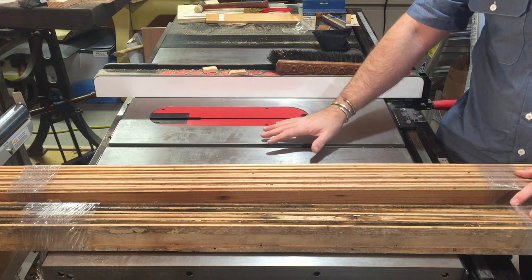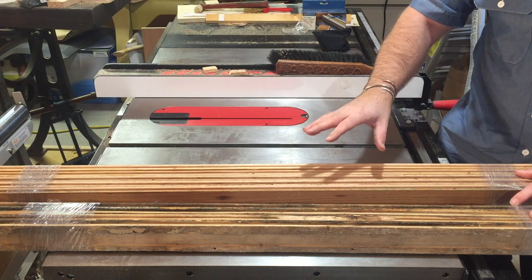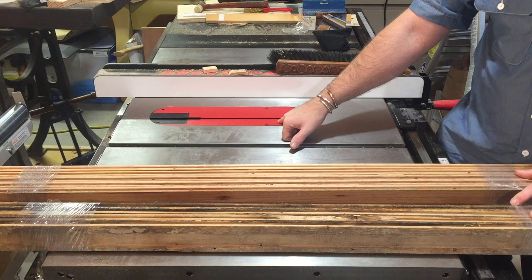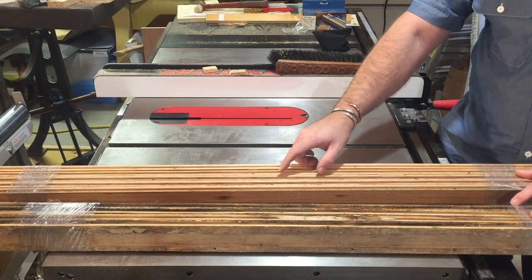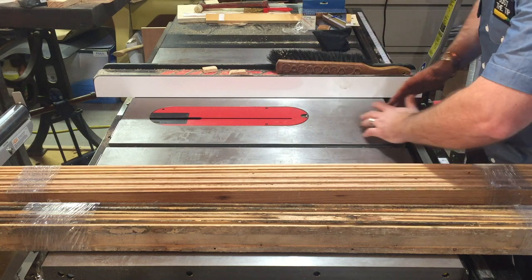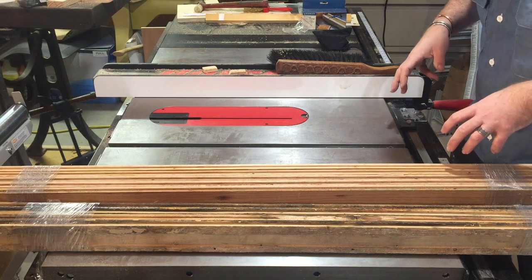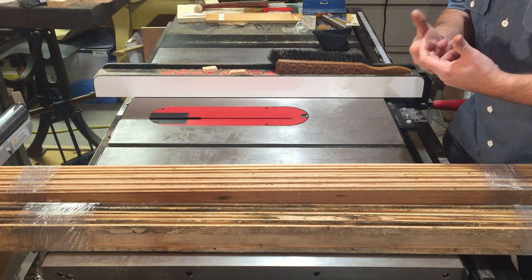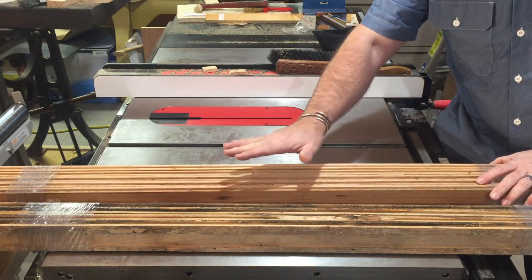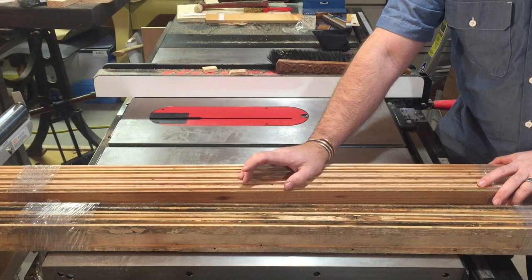Now, I am lucky enough that I have a SawStop in the shop, and I can tell you from firsthand experience that using treated wood, or wood directly from a home center with a high moisture content, will trip the blade, and when that happens, it's a huge high pucker factor. The other issue is if there's any sort of metal, not only do you ruin a blade, you also drop the brake, and when all that happens at a gazillion miles an hour as you're feeding stuff through, it's so scary. You get to keep all your fingers, but you may need to clean up after yourself a little. Anyway, I digress. Make sure you check all of your reclaimed wood really well, for both moisture and for any bits of metal.